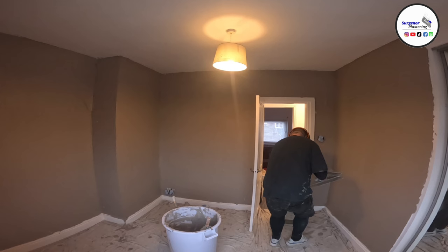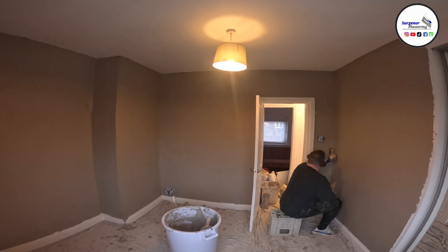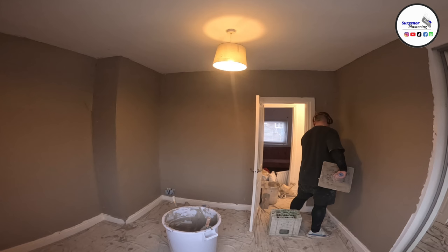If I had to come in here and instead of the 4 big walls in the chimney breast, there was like 7 smaller walls, I wouldn't have done them all at once, because there's too many angles to trowel and get right. Four buckets, and it was too much. And then we mixed some more, and we finished, we second coated it.